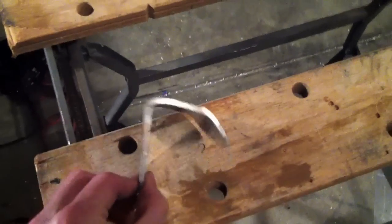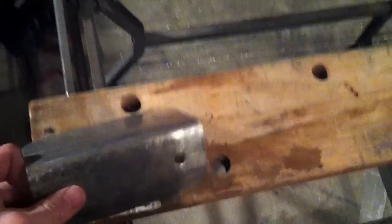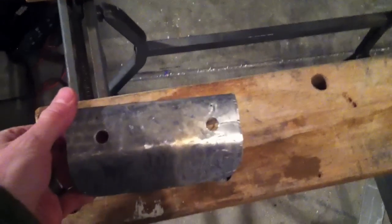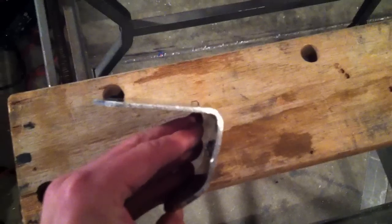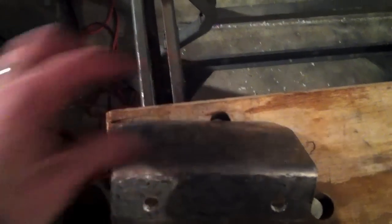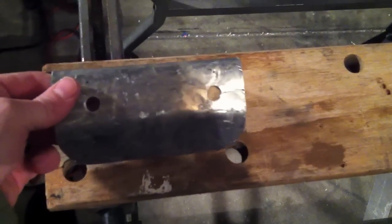Alright, everyone. I built the bracket for the front of the skid plate here. Very simple. It was a 6x6 piece of the stainless there. Bent it out to fit the curvature of the front of the plate, and then of course flat on top for to bolt up. I have not drilled the holes in yet. I got to get under and measure the Jeep to see where the holes are located on that one. However, I did do the front so that I can do this.